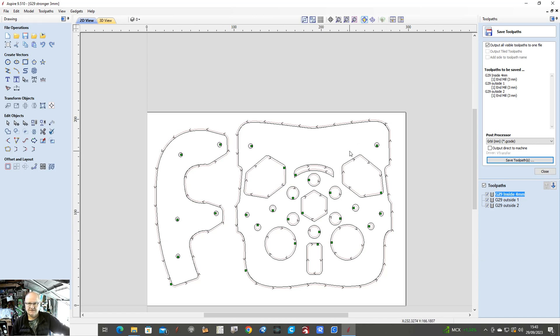It's an A4 size, so I can get that out and one handle. The other A4 pattern gets three handles out. Depending on what you want to do it out of — if you're doing it out of 6 or 8mm aluminium plate, you'll only need one of these and two of those because it's quite strong enough. This is just the way I did it for cost. You could use carbon fibre, but it's more expensive. I think it costs around about £10 to do the steering wheel, so cost-effectiveness, it's worth it.